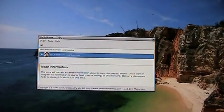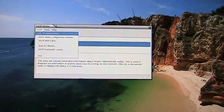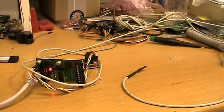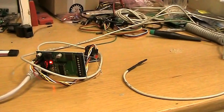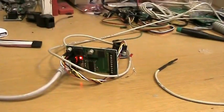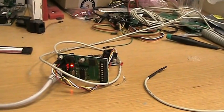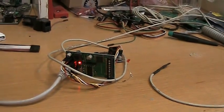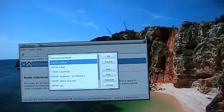So what we have set up here now is a setup that will have the LED on the board here turned off as long as the temperature is under 27 degrees, and which will turn on when we go over 29 degrees. So let's look at how it looks. And for that we open a client window. Again, it's a socket CAN here, and see what we have.